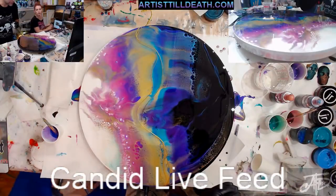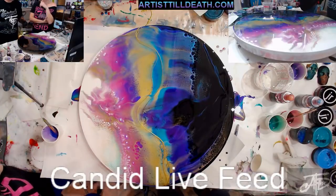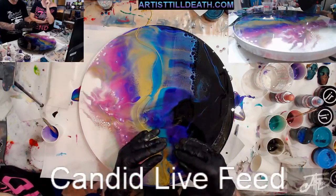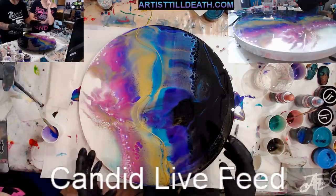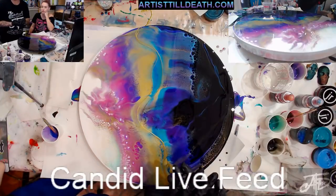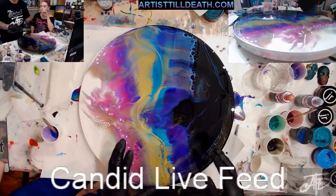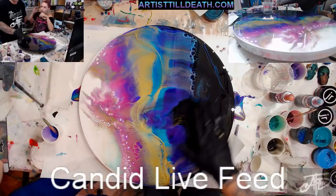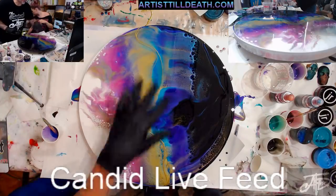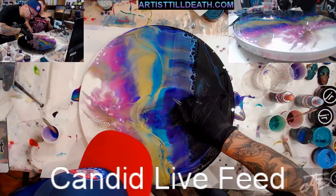You don't have to put a clear coat over the top of this — it already has a great finish, especially with the gold. If you get trash in it or there's a divot, just let it dry for 24 hours. One thing with the gold — you're not going to want to sand the gold because that shimmer is on top. You'll sand that right off. You'll still be able to see the gold color but it won't have that shimmer. So put the gold right out of the cup at the end.